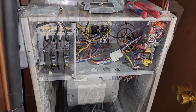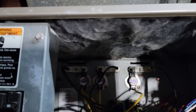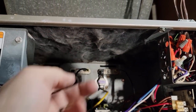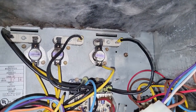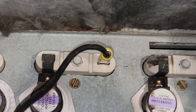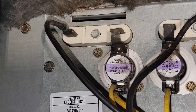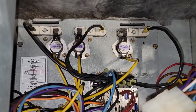Let's go ahead and check this heat pump out, make sure it's working. Went ahead and got the filter swapped out - she's got a few clean ones over there. We took that piece of insulation with the reflective coating off - it still has insulation there so it won't short out. Got new crimp-ons on there - that is not a normal crimp-on. Took the limits out, squeezed those down, they look better. The crimp-on there got replaced, and the other one was able to be squeezed down also.